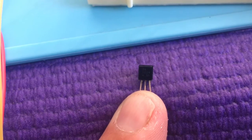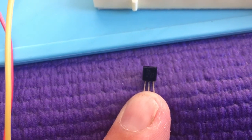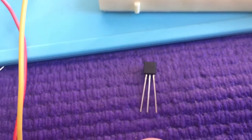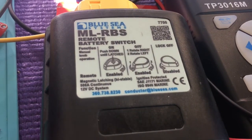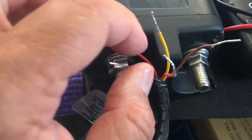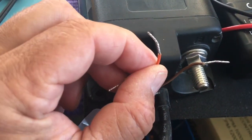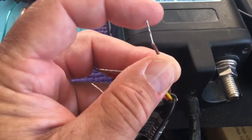What we're going to discover is that we can use a transistor — a 2N2222A — to drive one of these switches. If we make sure we provide sufficient power to the red wire and a good return on the black wire, we can use a transistor to drive the release on the orange wire, and another transistor circuit to drive the brown wire.